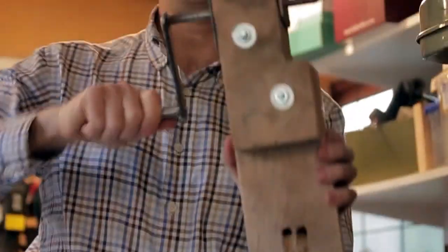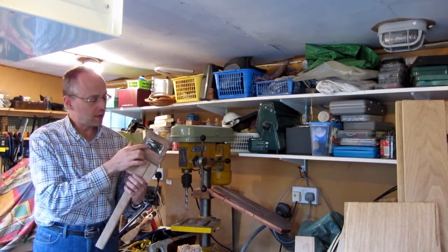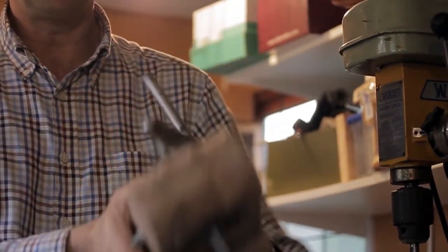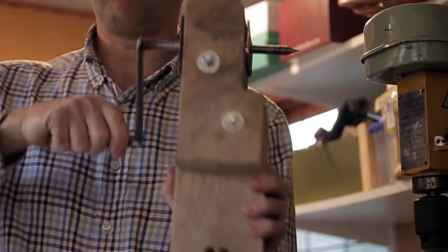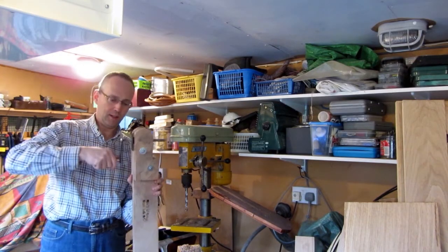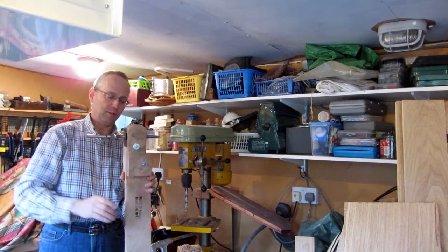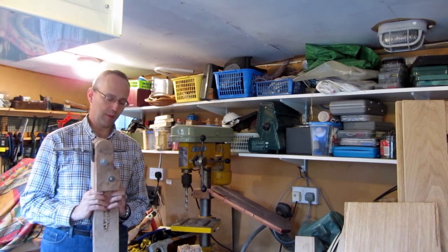I've got my crank handle and that's working all right. What I've done here is I've welded a couple of bolts on the inside of these metal plates, and this is just a bit of studding — I've welded a bit on the end here, sort of a crank cleaver. So that lets me adjust the lathe. It should be all right. And then it just rests on top of the lathe bed, so these sections both just rest on top of the lathe bed.